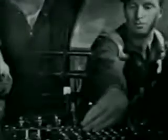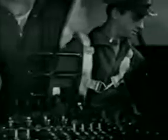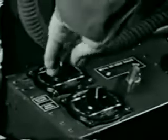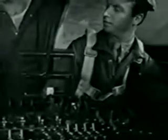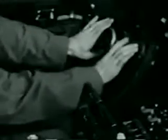See that all other switches are off before turning off the batteries and the main line. Booster pumps off. Landing gear, wing flaps, neutral. De-icer, anti-icer, off. Inverters? Inverters off only when the instruments have returned to neutral. Inverters off. Batteries off. Main line off. Lock control surfaces.